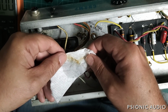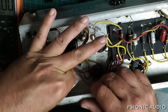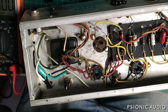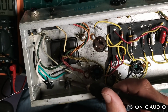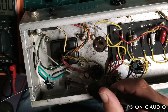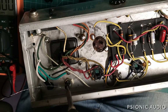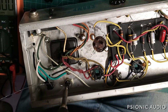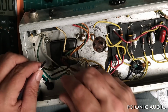This is stuff that would have been between us and a new good solder joint. Think of it as time travel, sadly without dinosaurs. All right, now tin the parts afresh. Adding that flux to it really thoroughly cleans it off, so my next stuff will really bond to it well. All right, so the hot's going to go there.